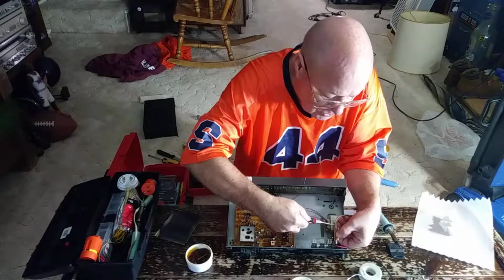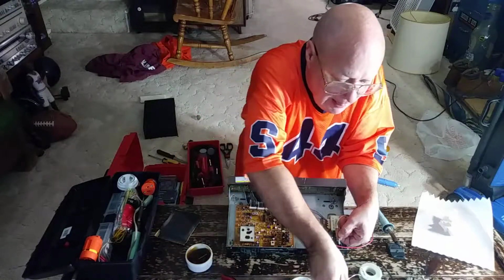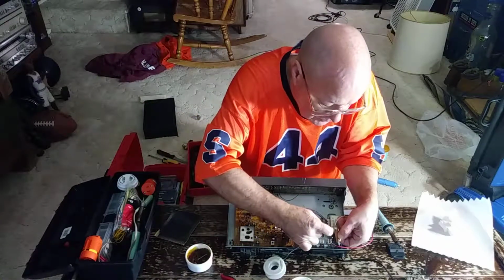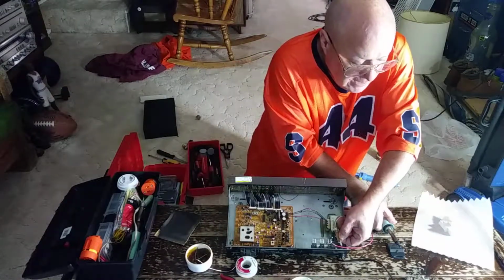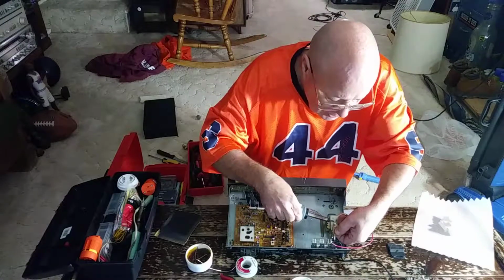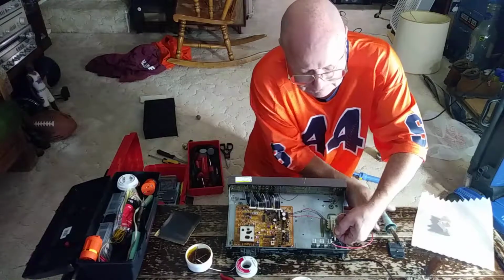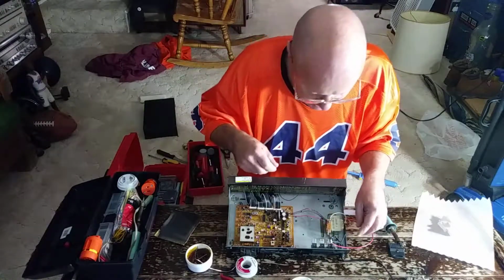And we'll shape it like this. And like that. Take our solder wire. I'll dip it in the flux there. I'll put some flux on the top and on the bottom here. And this is called drop soldering, so I will heat the terminal and the wire. Boy, that's a really nice clean solder joint there.